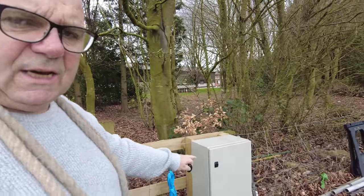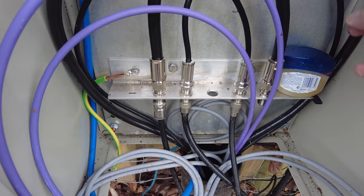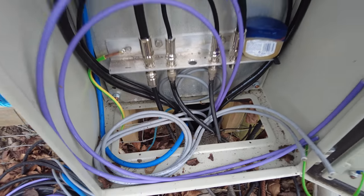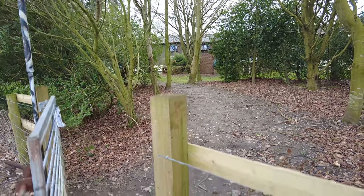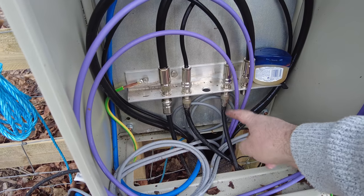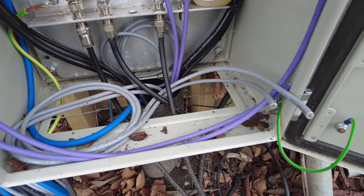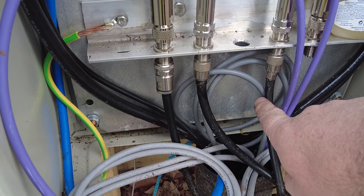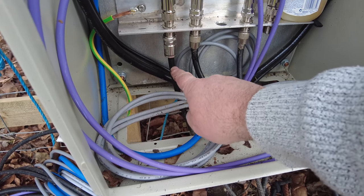In the antenna field, this is our box. The cables that come up here go all the way down into that tube and all the way over to the office — it's about 41 meters, around 130 feet. We've got some pretty heavy, low-loss coax. The stuff at the bottom goes out into the field. These two are receive loops and they go off to the office. That's my main transmit antenna at the moment.